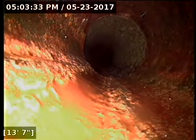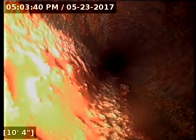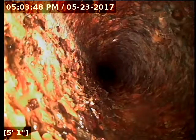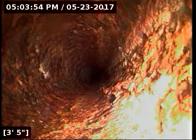It's hard to get a depth there because all the bushes are in the way of getting the locator all the way down to the ground. But I had it raised up off the ground a bit, and I was getting around 7.5 feet. So use some caution when digging there. Either way, I do recommend relocating just to double check the depths. I'm getting consistently deep depths throughout, but it's still worth doing.